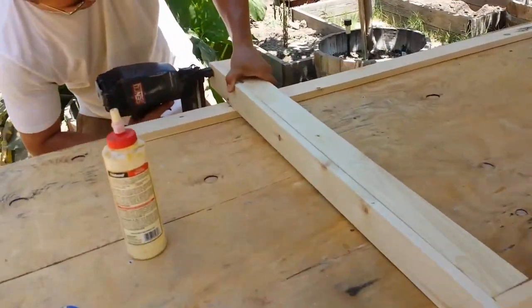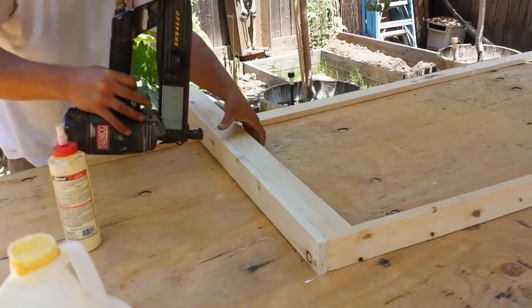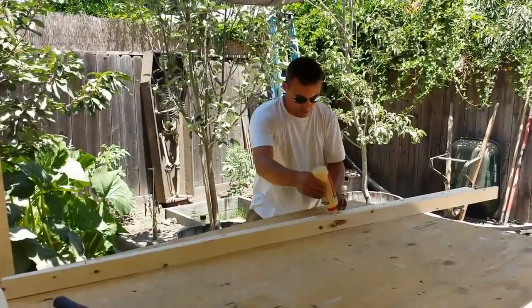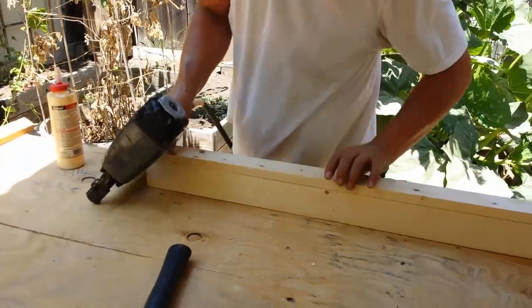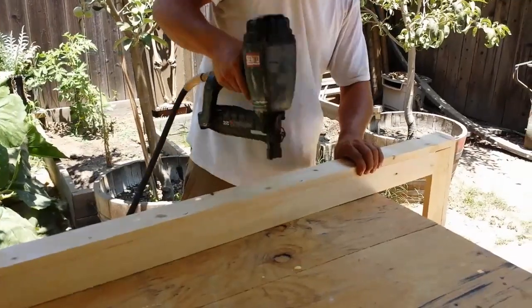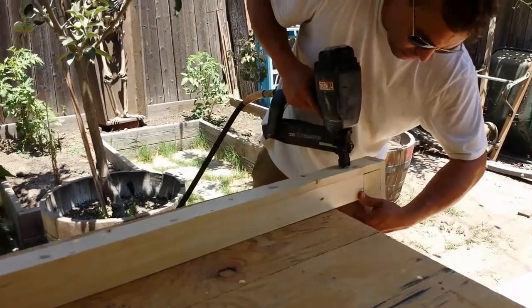In the past, we've made the bottoms of the support jacks 2 to 4 feet long, but for this one we chose to go 3 feet, just to save some space. But the thing to remember is the shorter that you go, the more weight you will need to hold the wall secure. If you're using the walls for something like a walk-through maze, you can also secure them using a 1x3 across the tops to connect them all together and hold them upright.